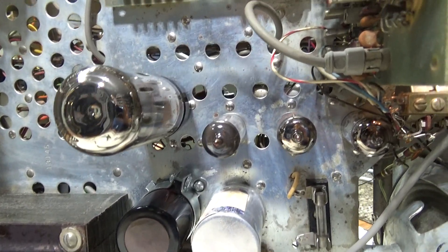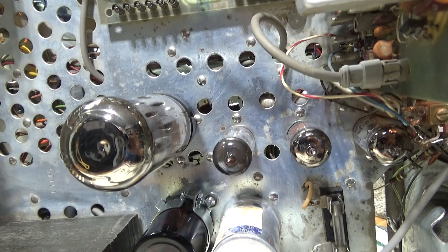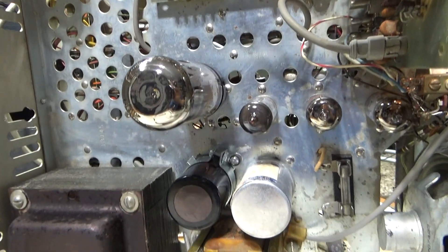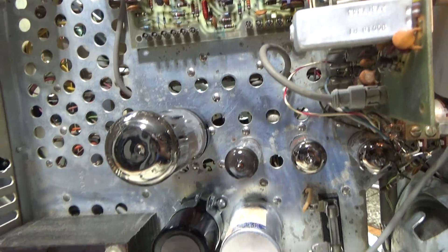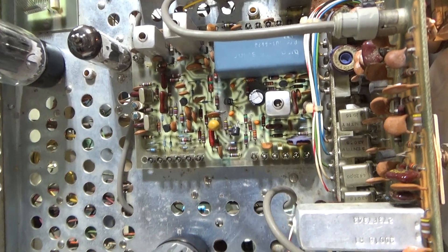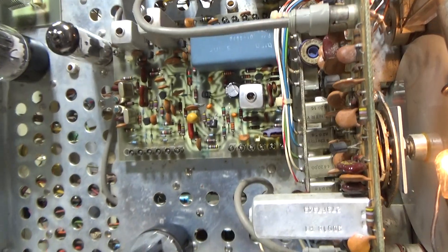I can feel the heat from this thing - the tubes are where all the heat is. When you put components on a circuit board right next to a tube that's also mounted on a circuit board, you've got heat problems - circuit board overheating, swelling, cold or hot solder joints, all kinds of problems. Because of that, this hardwired version with the steel chassis is considered the best and most desirable version. The later D201s were also 23 channel with circuit boards, and the D201A was circuit board but 40 channel.